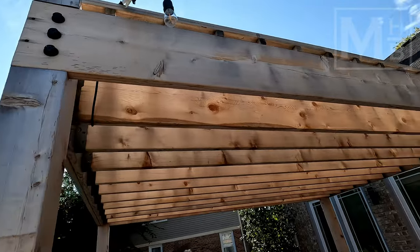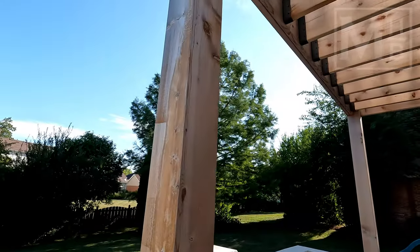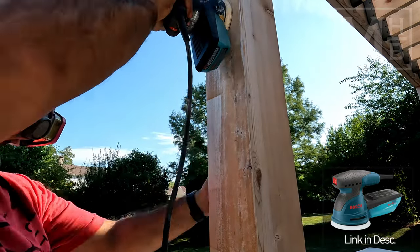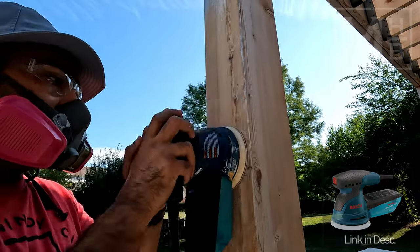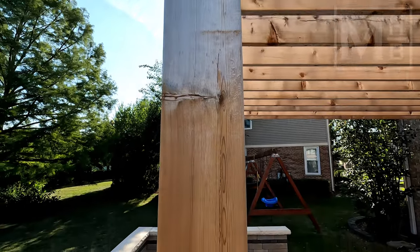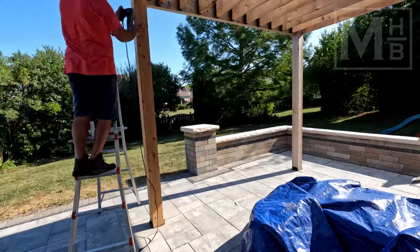We had a full day to dry and now it's time to get to sanding. I thought this was going to be a really quick sand, but with 60-grit it's taking quite a bit of time to get that silver off the cedar. I prefer the natural cedar color over the gray patina, so I'm going to spend the time to take it off. 60-grit and a lot of effort seems to be working just fine.